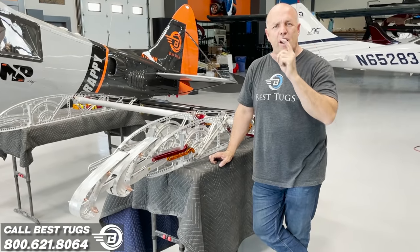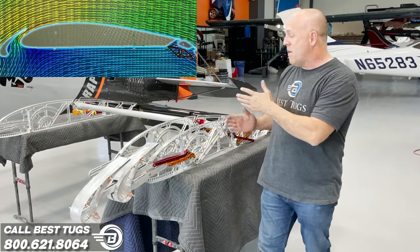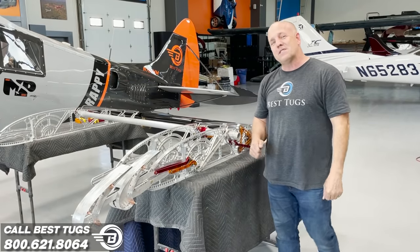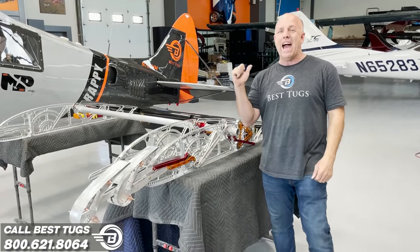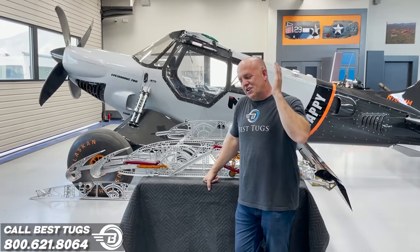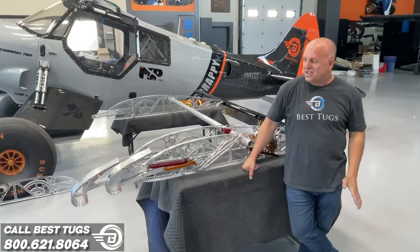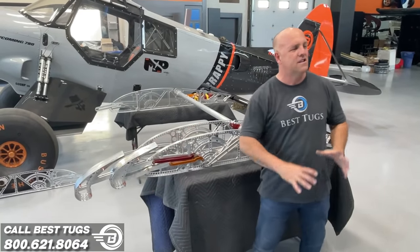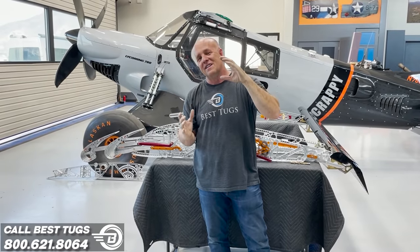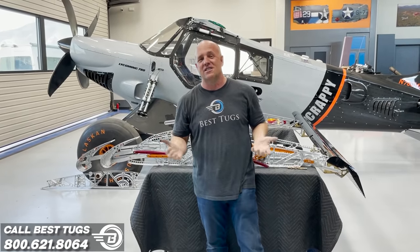What's the biggest gap at the front versus back? What happens if I align two? How much does my center of lift move forward? And can it compensate for what I'm doing at the back of the wing so that I don't need so much elevator? I had to do thousands of iterations of flow analysis to adjust all my ideas from a drooping leading edge that stayed connected with a slat, a double slat, a morphing front of a wing, and then do a flow analysis on all of them.